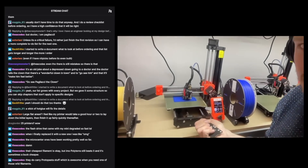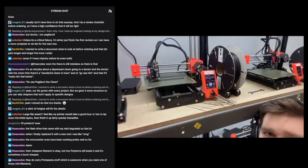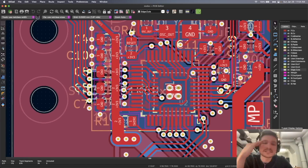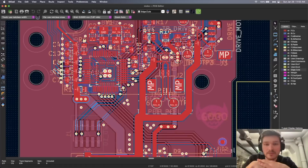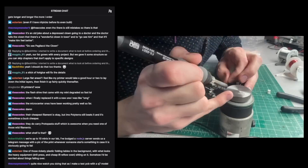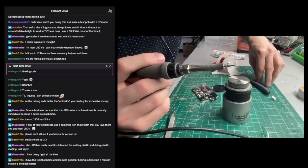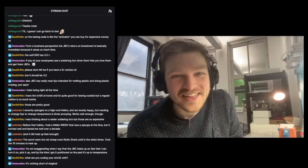The frame we designed is printing in blue and the stylus is printing in black. While those are running, I started in on some bodge wires — I just had to add a couple wires for the I2C display and then a few more to a connector for the stylus. I used really small enamel wire so I could patch them into individual pins on the microcontroller.